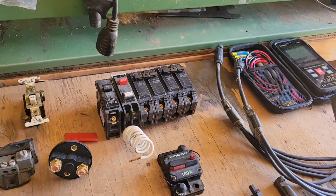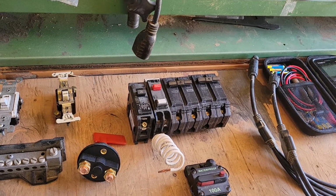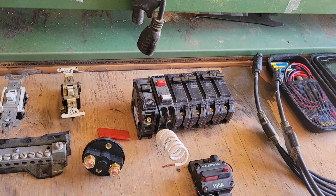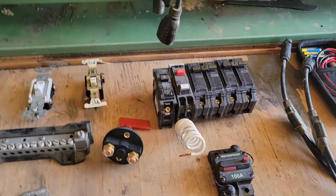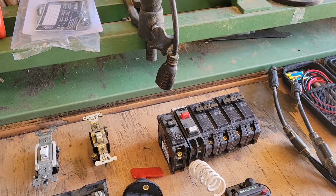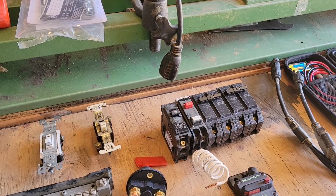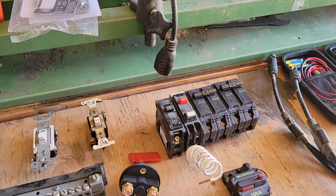Or have an electrician come in and give you a dedicated circuit in that room on its own 20 amp breaker, so nothing else is plugged in, just that one heater. And don't go plugging your hair dryer into the same circuit while the heater's running. You'll pop the circuit in an instant.